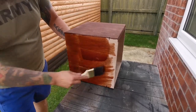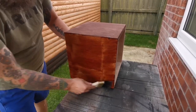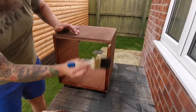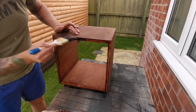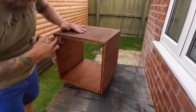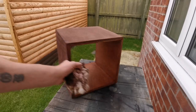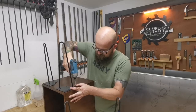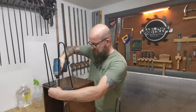Next I use some dark walnut wood stain — this is ethanol-based and it's really good because you can apply it and leave it on for a few minutes. The longer you leave it on the darker it goes, and then you wipe off the excess. If you wipe it off quicker you'll get a lighter tone, and if you leave it on a little bit longer you'll get a darker tone. It also doesn't go blotchy like the water-based stuff, or raise the grain.